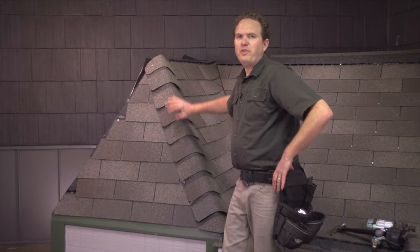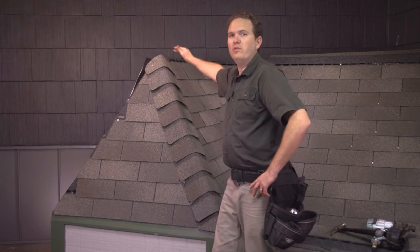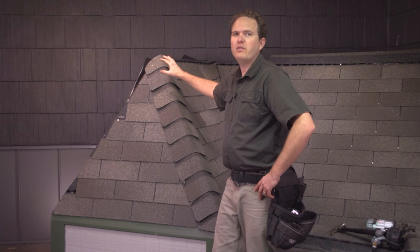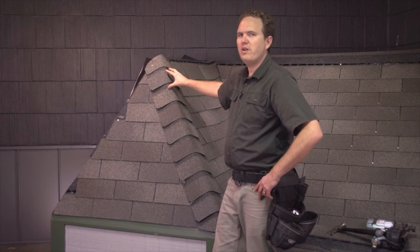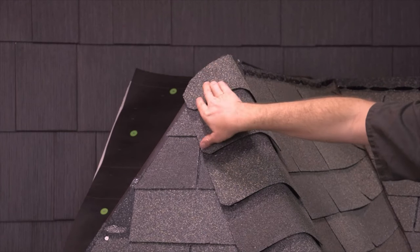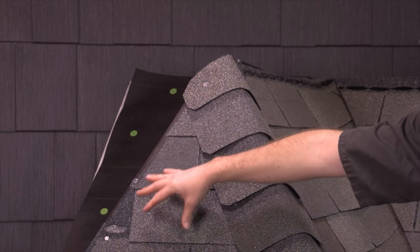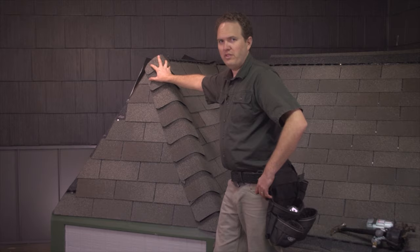When you reach the top of your hip, be careful to hide the nails on your last shingle as it transitions into the ridge section. You may end up having some face nails that will need a bead of sealant and roof cement applied over top — it depends on the configuration and geometry of your roof. We had to cut a little tab here and face nail it, but in this case when we get the cap shingles on coming up this hip and the ridge shingles, I think all of these face nails we put in are going to be covered.